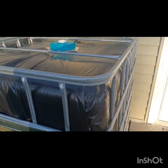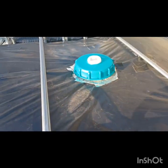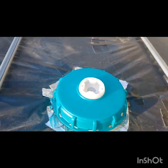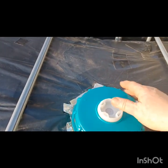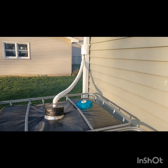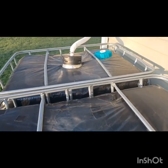These barrels will come out of here — the big plastic barrels have some screws on the side. You just undo the bars on top and you can tip it over; they're not all that heavy. I had a little damage on this one over the winter, so I taped it up — might have to replace the plastic next year. I've got the cap on here loosely. You can see there is water in there; it's about a third of the way up. My roof is big enough where about two inches of rainfall will actually fill these up and then some. If they do overfill, the rain diverter will cause water to go down the gutter instead of into the barrels.